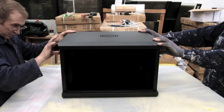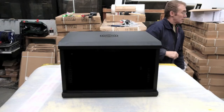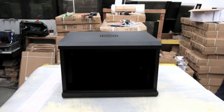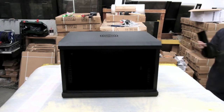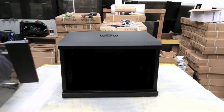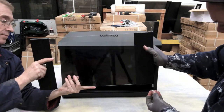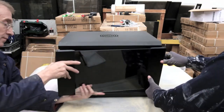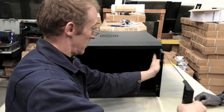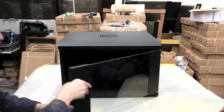You can do that pre or post when the cabinet is on the wall — it's entirely up to you. What's left is the front glass door. Please be careful as this is tempered glass and it can shatter, so make sure it's done on the correct work surface. It's hinged as you can see from the front with spring hinges. You need to put the nylon washers in place as shown in the video. Make sure that's lined up and it just springs into position.